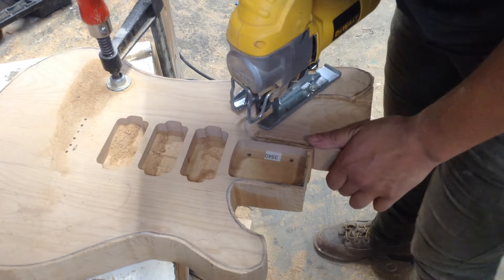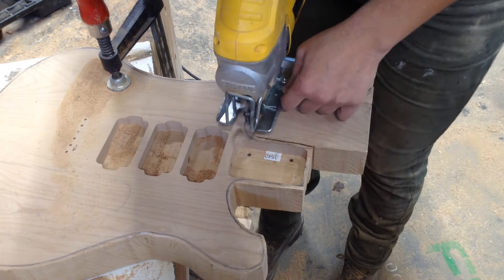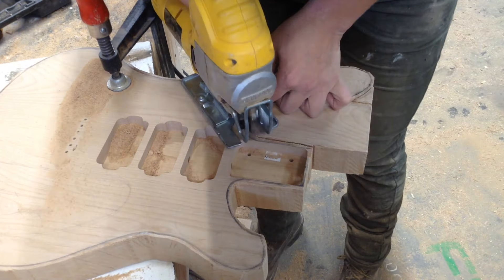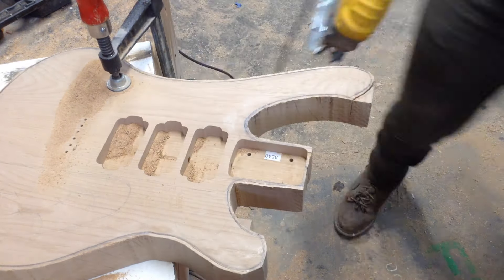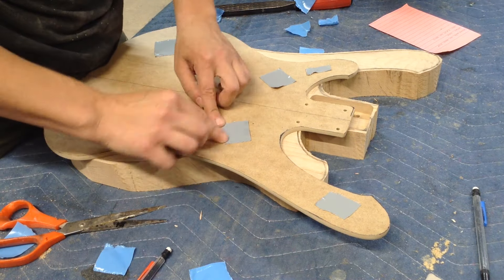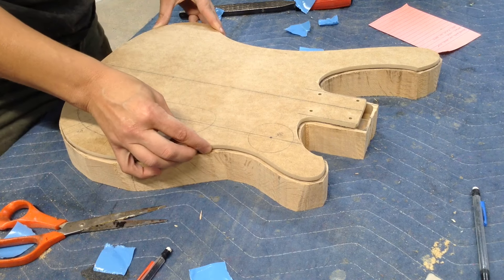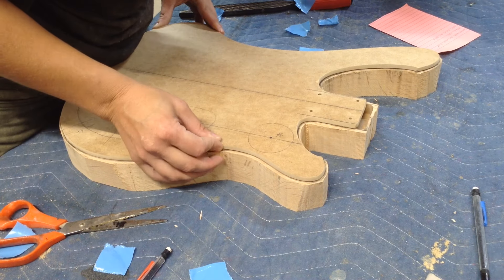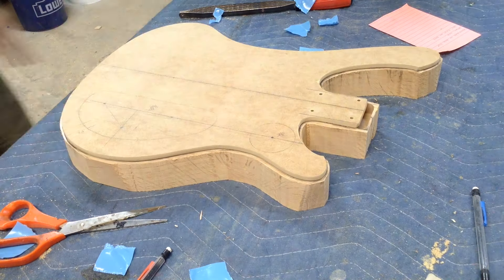So I'm going through with my jigsaw and you can see I'm cutting within about an eighth of an inch of the line I drew, removing the bulk of the material. He actually asked me to save some of this for him so he could do some testing with the finish he was going to put on it. If you do any routing work with a pattern cutting bit, your best friend is going to be double-sided tape — I believe this is Gorilla Glue brand. It's one of my favorites and it's inexpensive.